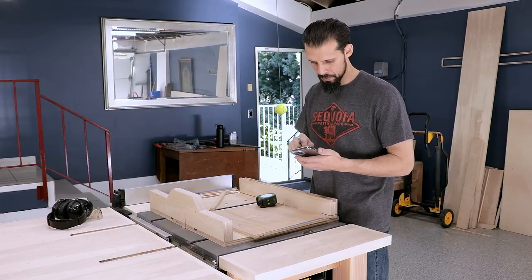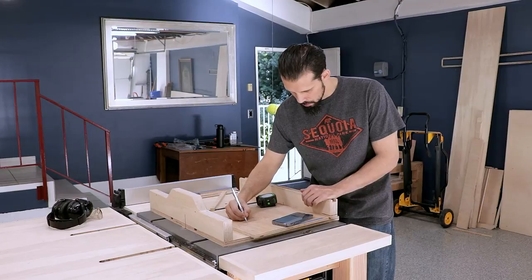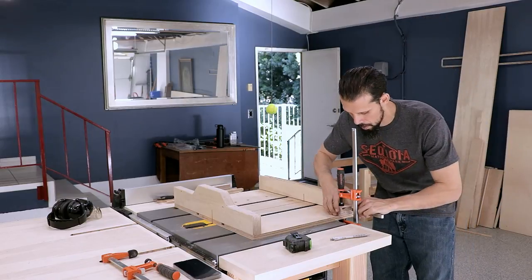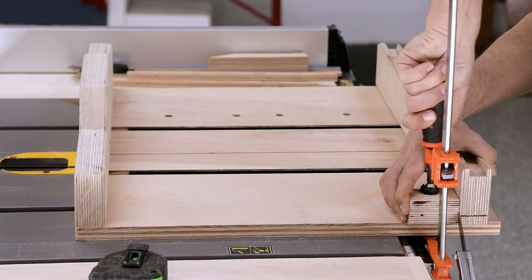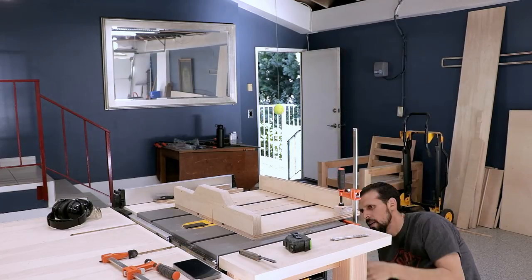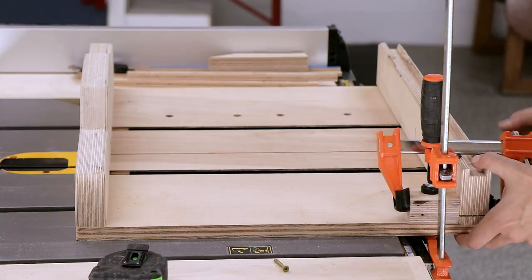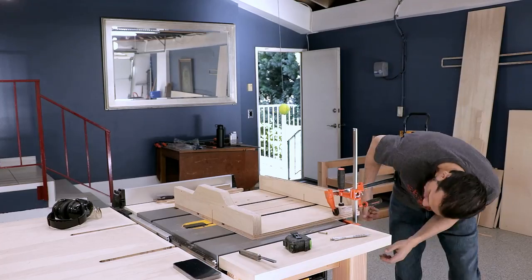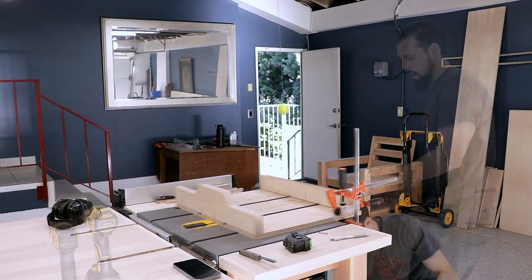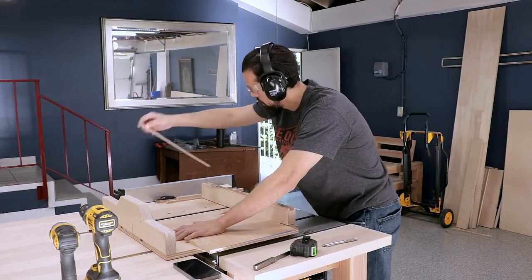You can do this calculation by hand or use an online calculator — I'll put a link below where you just input the numbers and it tells you what to do. I had to adjust by a small amount, so I used feeler gauges to get the exact adjustment needed, clamped them in between, then released the temporary screw and moved the fence to meet that adjustment, clamped it, and screwed it back down. Just to be safe I unclamped everything and ran the five-cut method one more time.